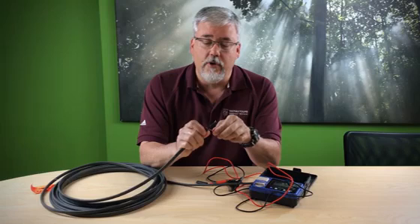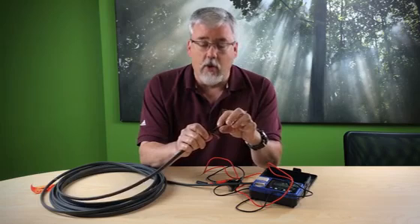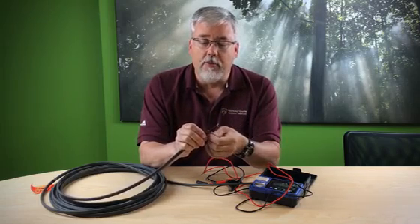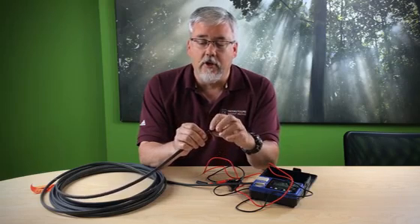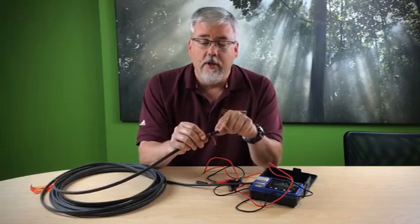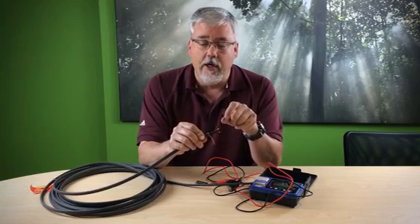What that leaves you with is a ground that goes around the cable and then these little black covered wires here. We trim this back a couple inches, we separate the grounds, we then remove the inner cover because there's another layer of insulation inside here. And then that will reveal this black inner core and the wires. This black inner core is what conducts the electricity between the two bus wires, or the two cables inside, which are right here.